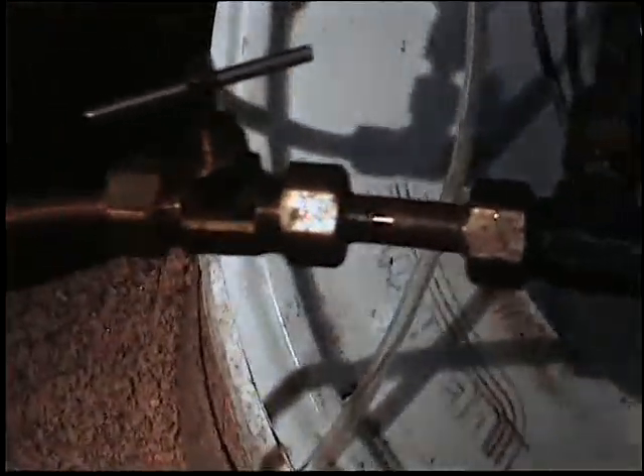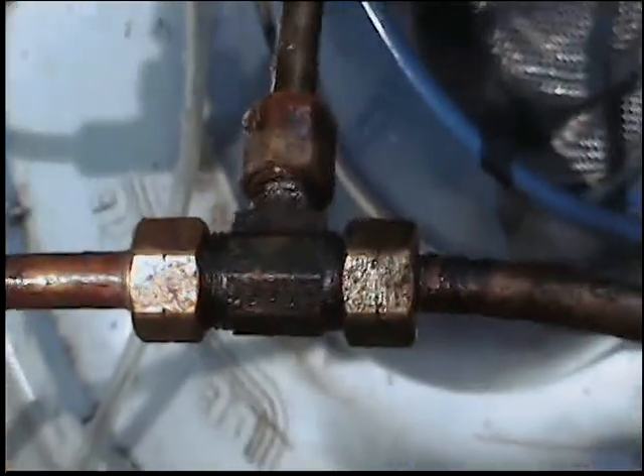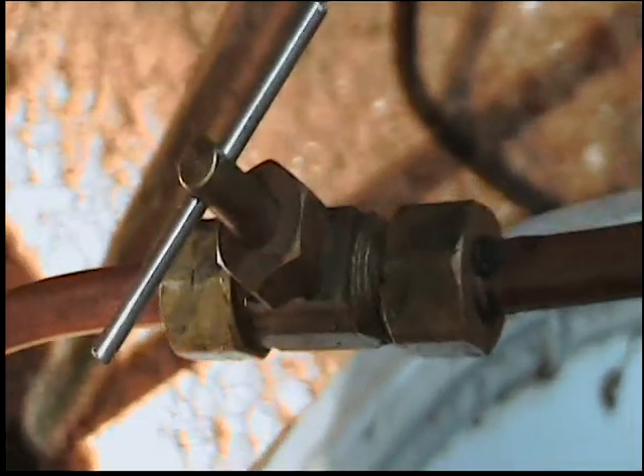Once we get going we can turn that off, unplug it, and run off steam. There's also another valve coming in here that can be turned off. To start the burner we use propane — propane comes in to light the ball, and that same propane is on the same tubing system as the steam. There's a valve over here; that's the steam coming in from the Babington burner itself, so it's shut off when we start with propane, which is teed in here and turned on, and it all goes to the same system where we can tee in and run the airlift pump.